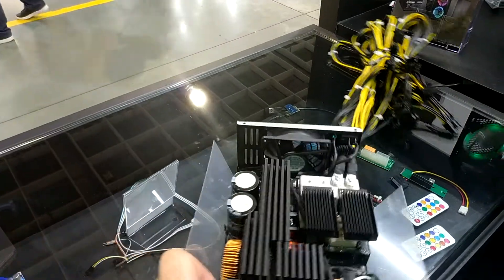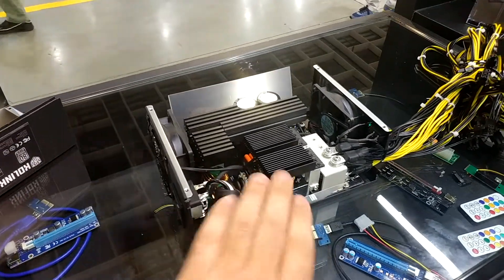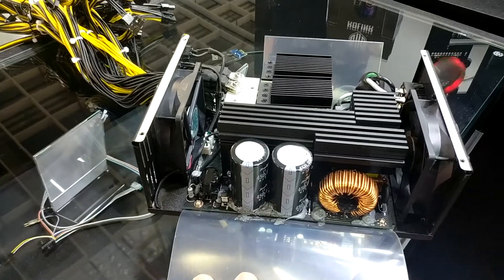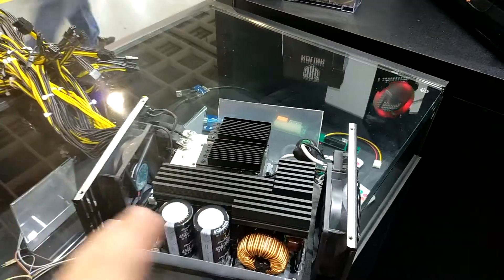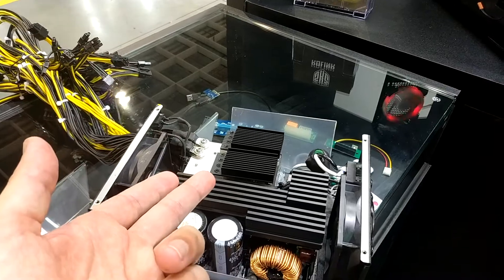It's 12 volt only — that's interesting. The platform is from Enhanced Electronics. Philip allowed us to open the PSU and take a better look at the internals. As I can see, it uses a 2-fan configuration instead of a top-mounted fan like most of today's PSUs. You've told me that this provides better cooling at the internals.